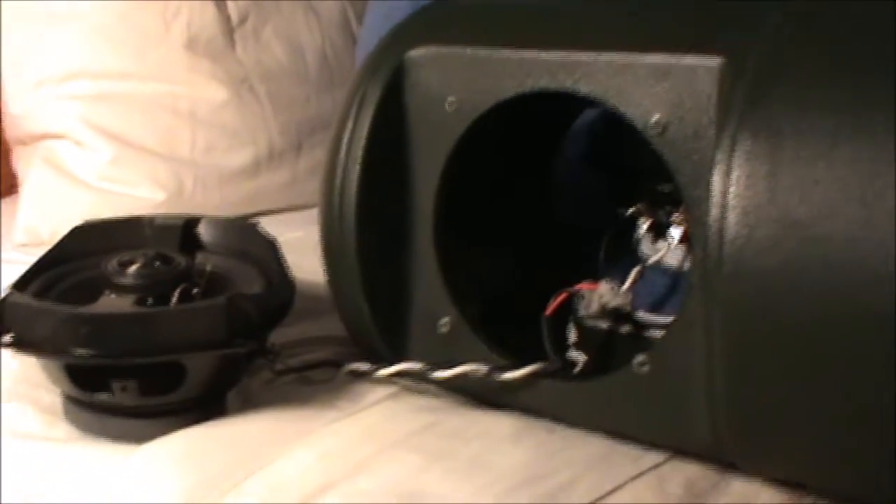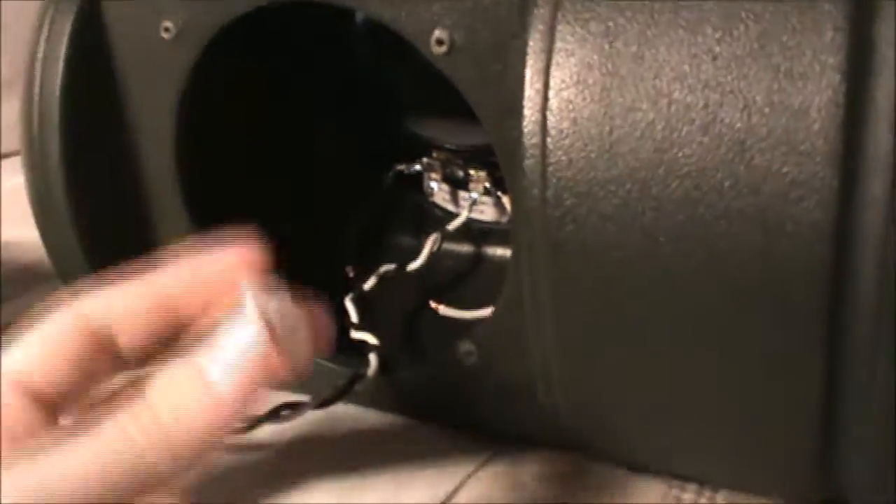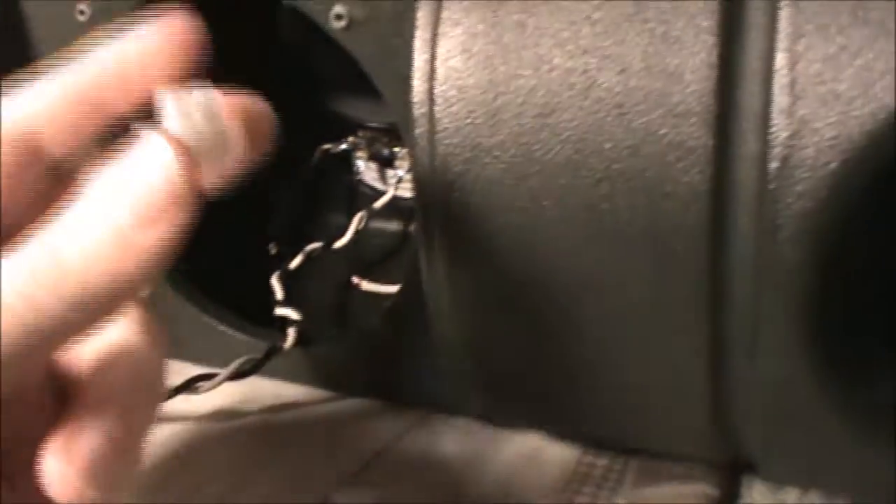Okay, so I'll try my best to explain this. Basically, when you purchase this speaker new, this big guy — the transformer — will be sitting just inside the cabinet on that little silver plate there. You can see that silver plate; this is where the top screws of the transformer will be connected. What you'll need to do is just unscrew that from that side. If you want, you can even remove the whole panel — there are two screws on that side. But once you've gotten rid of the transformer, you need to splice the wires. I've decided to actually remove the installation I had and start again, because it's difficult to explain without a visual element.